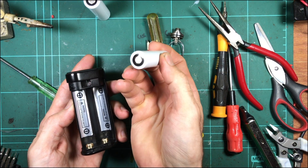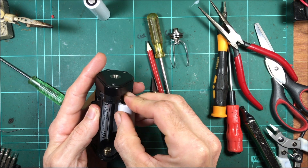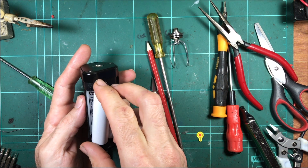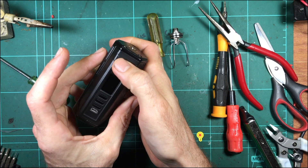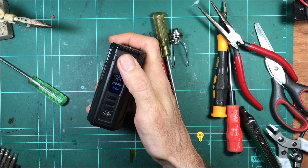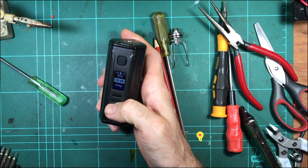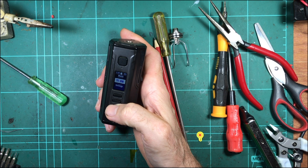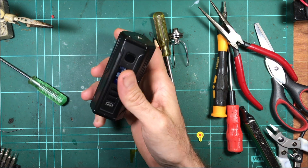We're now in normal series mode orientation instead of the goofy both-positives-up arrangement. And it's alive! Working - I'm pretty happy about that. Should have less voltage drop over those wires, and they're thicker wires as well, so that'll also help. Fixed the tube as well.